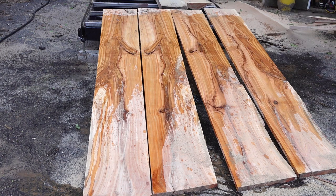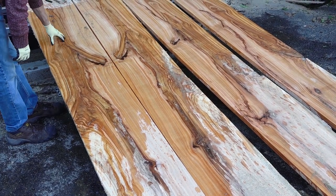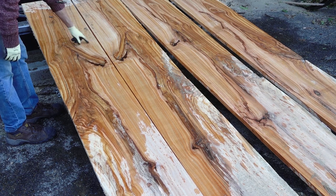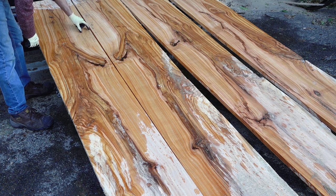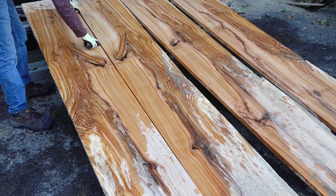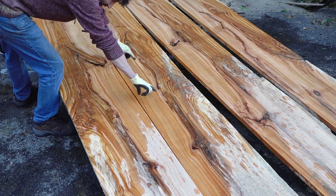I've used a lot of stuff like this over the years, just cutting around the rot. So over here you can see all the staining through here. This is still pretty good, but it is rot stained, so it does have a different look than the normal cherry, which is gonna be over here. But this is a piece of quarter sawn stock right through here. So if you wanna pull like a door style or rail from here and have quarter sawn stock for that, there is your quarter sawn door parts there, and there's some more nice clear stuff here.